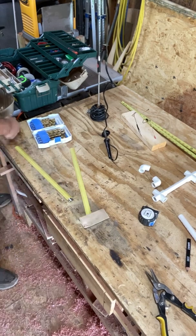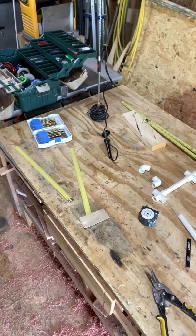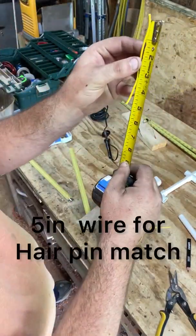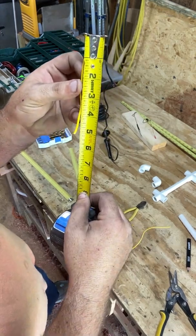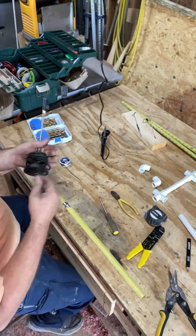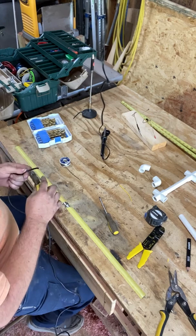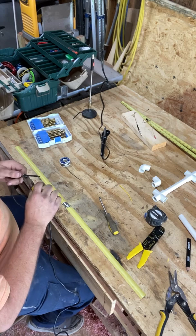As you can see, one step I didn't forget — I've got to have a five-inch piece of wire. You probably can't see that on camera, but I'll try my best to show you. Exactly five inches. This is just an old CB antenna from Walmart that I've had forever. I'm going to strip a little bit of the outer jacket.